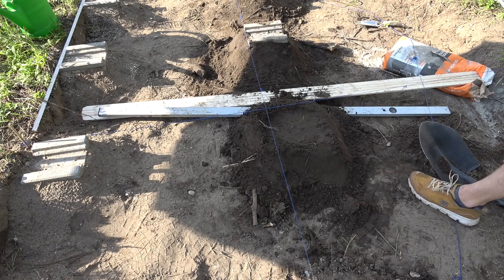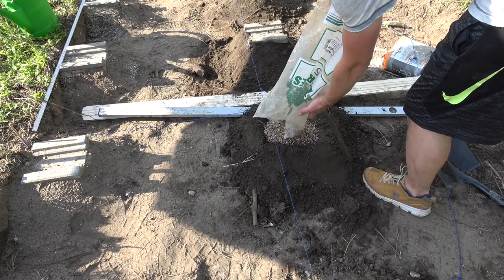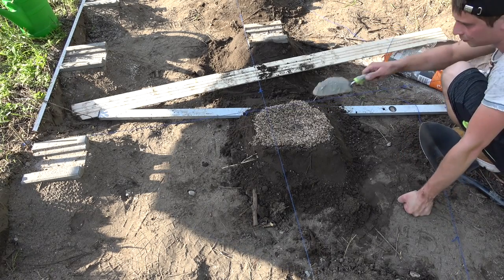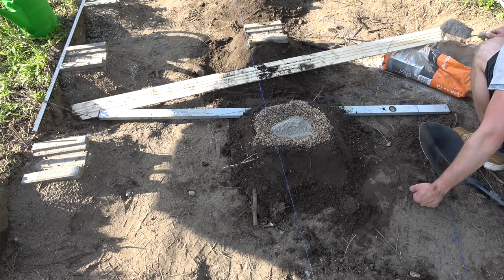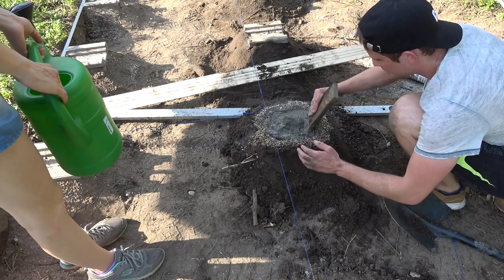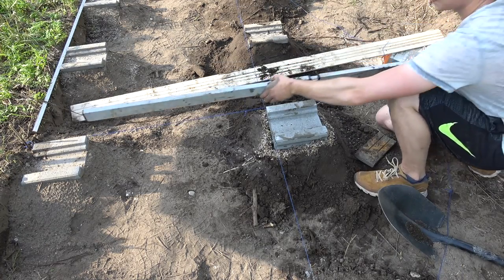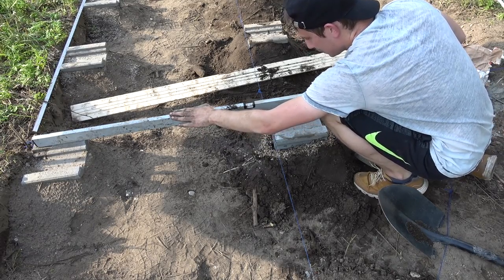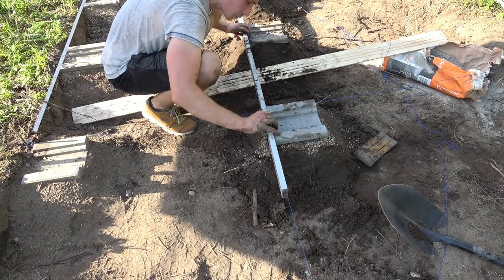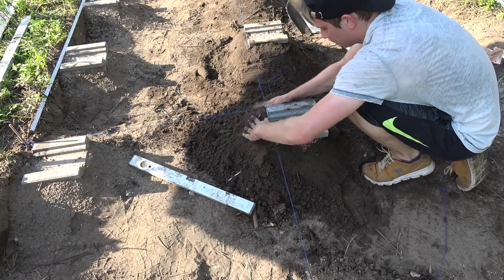You won't use the mathematics you learn in school later in life — yeah, you bet you are going to use it somehow. Next, I placed a simple point concrete foundation consisting of 18 stones embedded in a mix of concrete and gravel. First, shovel up a dirt heap and cover the top with gravel. Then mix the concrete, and last but not least place the stone, making sure that everything is square and level. Then I covered the heap with a bit more dirt to prevent the concrete from hardening too quickly in the high temperatures.